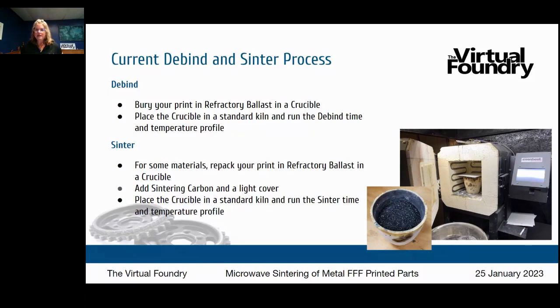A question came up: how accurately can the user calculate the change in size of the 3D part that occurs after sintering? It's about shrinkage. As your metal particles are fusing together in sintering, they will shrink. If you are following the instructions we post on our website, you can expect 7% to 10% shrink. So you'll size your part up about 7% to 10% in the modeling stage — print it a little bit larger, then expect it to shrink by that amount following the recipe we provide.